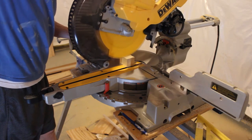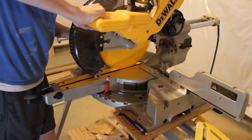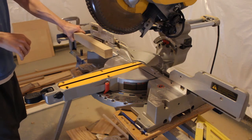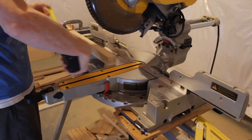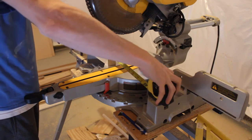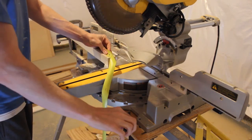I'm taking these two clamped pieces of poplar and squaring off one of the ends. These boards are longer than I need them to be, so I'm going to square off one end with the miter saw, then turn the stack around and mark it for my final length. Now I know those two boards are identical in length, and that's going to help with our finish quality — there won't be any mismatch.